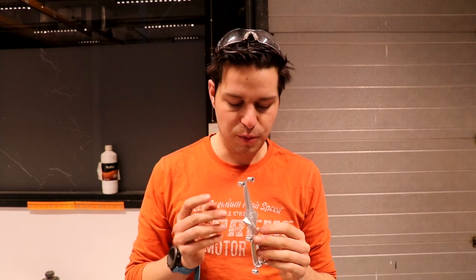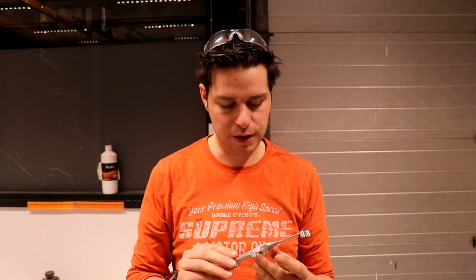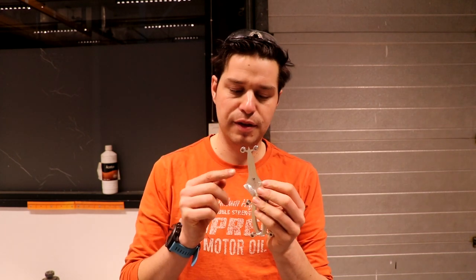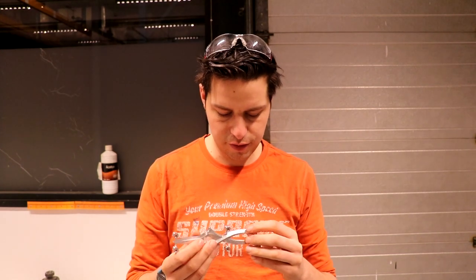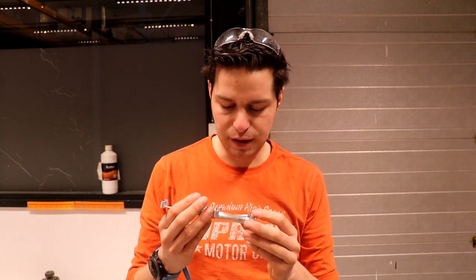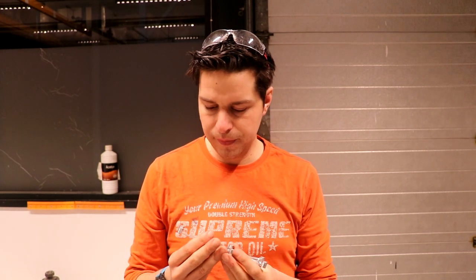The thing is, I'm realizing I need to get closer to a sellable product. So that means the engravings need to be spot on. On some places there is the entry line of the mill. Not acceptable at the moment. I also noticed that the screws were loosening in the fixture, so I need to order longer screws so that they have more threads to catch onto to make sure that they're staying tight.